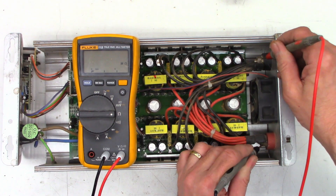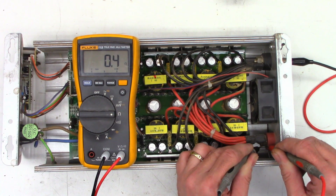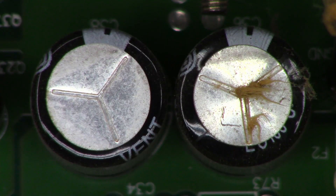I'm going to do an ohm check on the terminals. I've got 0.4 ohms, and if I short the leads together I get 0.4 to 0.3 — so about one-tenth of an ohm. Take a look at that — if you've been watching my channel for any amount of time, you'll notice that capacitor is bulged, and it even split. It let some of the packing out, which is why there are marks on the top of the capacitor. If it builds undue pressure, that will rupture, and you can actually see the cracks in the capacitor.